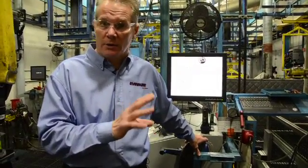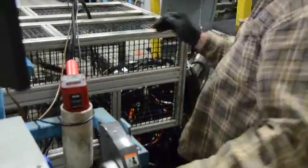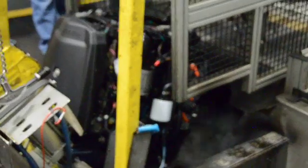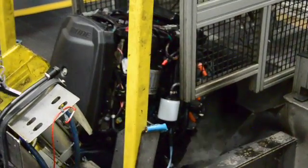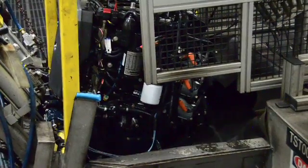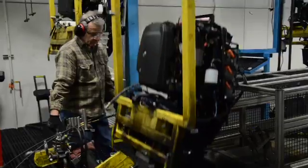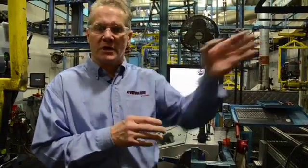Now we're in final test. Every motor we put together in this facility comes through this operation — everything gets 100% tested. We use a standard propeller in a normal test tank with about seven tons of water. We use a prompt-and-response system: the operator scans the motor, the computer prompts the operator to set up the test parameters and check every feature. By the time we're done, we will have checked a whole host of parameters — from idle quality to oil flow, air flow, fuel flow, water pressures, temperatures, RPMs, and alternator output. If it's not exactly what's expected, we send it to repair.